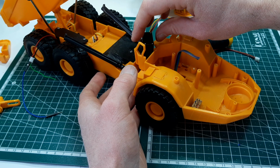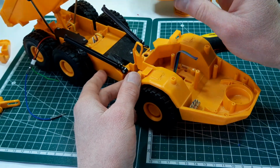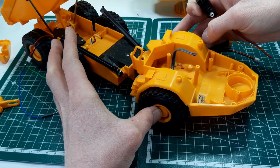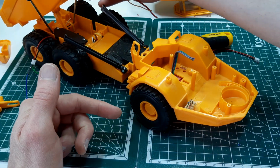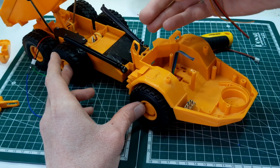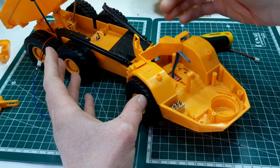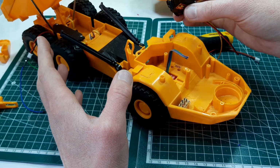And then we can make our limit adjustments in the software to make sure that the servo is not trying to bend too far. The servo might struggle to twist all of these tires when it's fully loaded, so we might end up having to try and do some sort of a software trick, so that, say, these 2 wheels drive forward, these 2 drive in reverse, this one drives in reverse, and this one drives in forward, so that when the servo is turning this part this way, these wheels are driving towards each other and these wheels are driving away from each other, so that the servo's not doing all the work. It's not having to drag all of this rubber sideways. So we might need to do that. We're going to have to test it out, really.